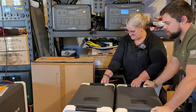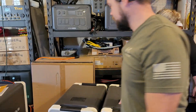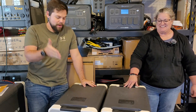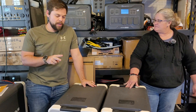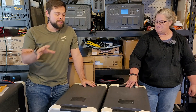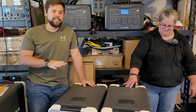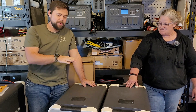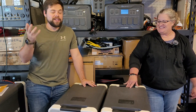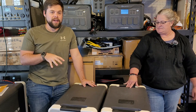Welcome back to the Minuteman Prep YouTube channel. This is Kathy, and she has never put an Apollo system together. This is a great opportunity to show what it's like for someone going through it for the first time — setting up two Apollos with two expansion batteries in a 240-volt split phase configuration. This will be 6,000 watts output at 240 volts to run an entire house. The units have been reset as if out of the box in single phase, with no cables connected and nothing programmed.